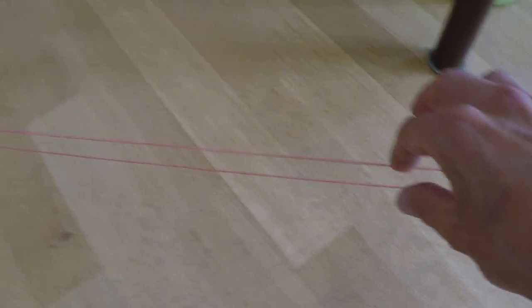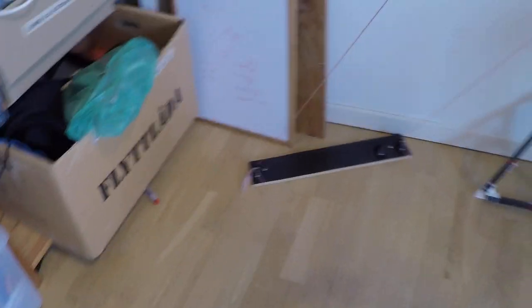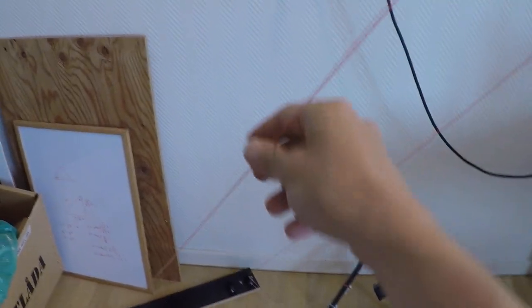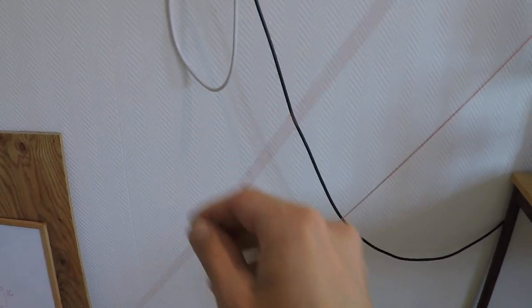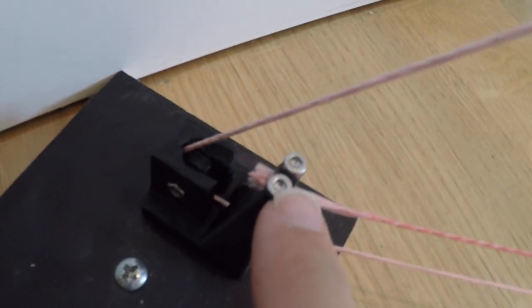As the line twisted more and more, it got shorter and shorter. So this line looked slack while this one was like a string on a guitar. In the end, the safety mechanism on top — not in that corner but in another corner — released, because when one line is tight all lines get tight. It said 'pop' and the print failed. I could also see the object actually slanting towards that corner.